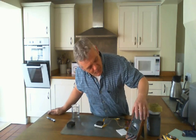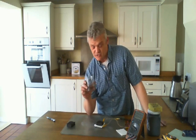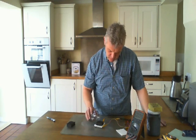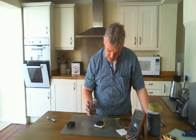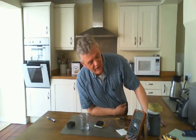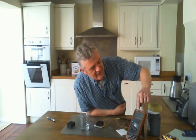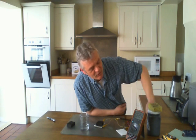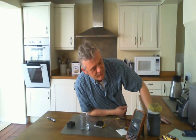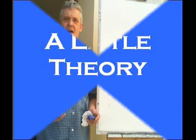Obviously it doesn't work at the moment - let's turn it on because it needs some electrolyte. What I've got here is just ordinary salt water. You pour the salt water through the sponge until it wets the paper towel, and you will see immediately that it has jumped up to 0.68 volts. That is probably one of the simplest batteries ever - a metal-air battery.